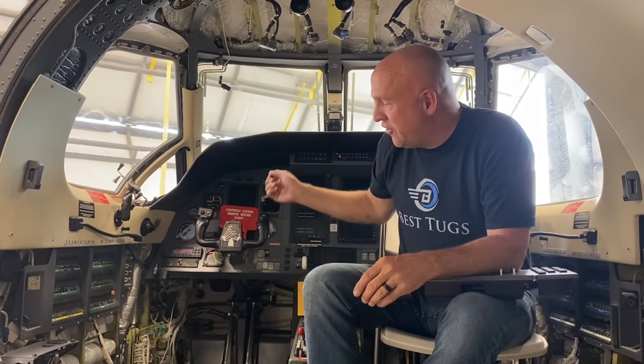There was also a service bulletin. It's not required, it wasn't an AD, but a service bulletin to take the ground wire that was coming off that alternator and pull it out from being connected here and install it up here on the firewall. It didn't need to be done, but for me to get rid of 12 feet of wire, and then the new larger wire just being a 2 foot run instead of a run all the way back under here, awesome service bulletin. If you care about weight, if you're doing updates in your plane, just get that service bulletin done. Take out a few pounds of the airplane.